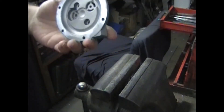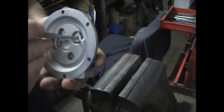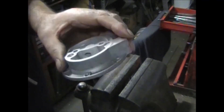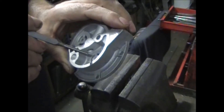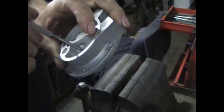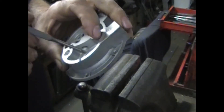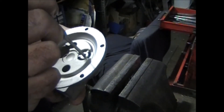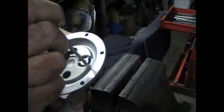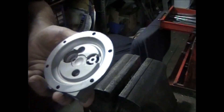After you've knocked out the old valves using that 1/8th inch punch, you'll see a mushroom shape on the top, then there's a spring, and then there's another one of those valve plates. Come in from the other side and just keep tapping — not real hard, just keep tapping away at it and it'll knock that right out.